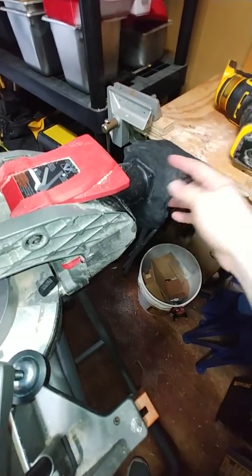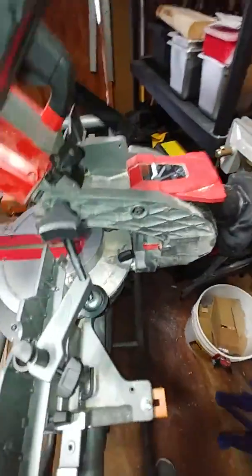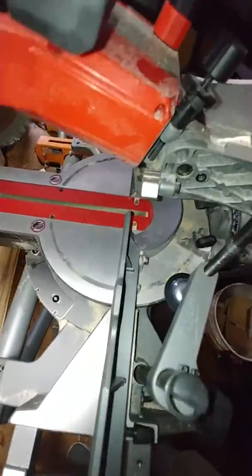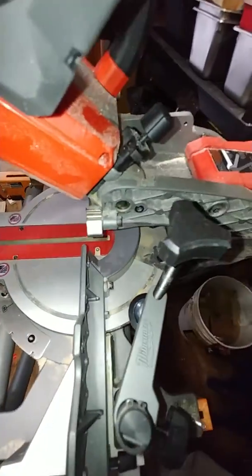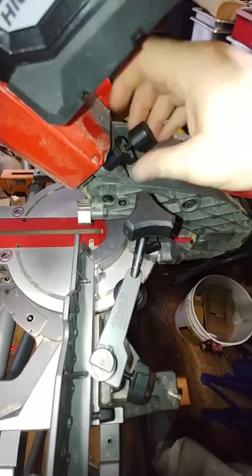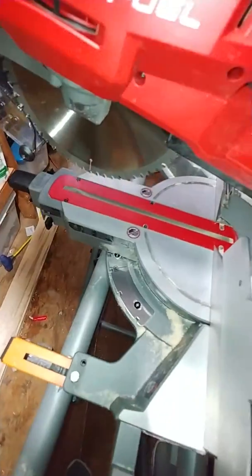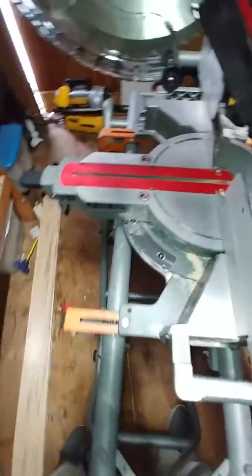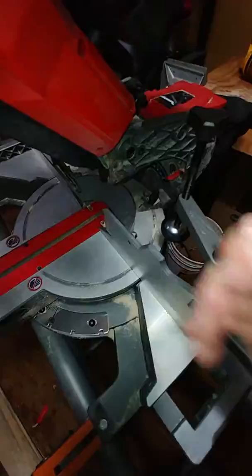This design — a couple days in and it's going to be broken if you're moving it around a job site. Not a deal breaker, but something to think about. Moving up from there, there's a blade stop: you adjust this screw to wherever you want and it'll stop the blade at whatever point you need — so you could hypothetically dado out material. If you don't want that feature, it just flips up. It takes just one battery, which is nice.